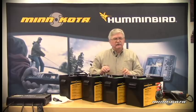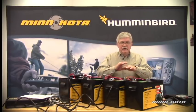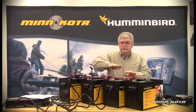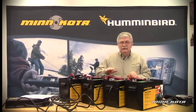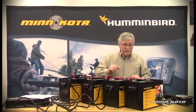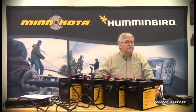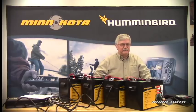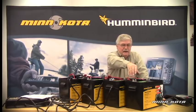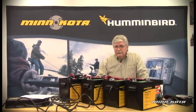First of all, let's talk about safety. Any time you're working with lead acid batteries, it's a good idea to make sure that you're not wearing any jewelry. If you happen to be wearing a watch, make sure that you remove that. We don't want to bridge across anywhere where we could have potentially hundreds of amps discharging through a ring on our finger or any other jewelry. Additionally, it's a good idea to wear some eye protection. Shielded eyewear is always a good choice. And again, the electrolyte in these batteries is highly corrosive, so you might want to wear old clothing when working with batteries.